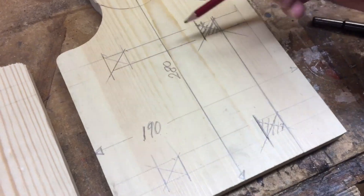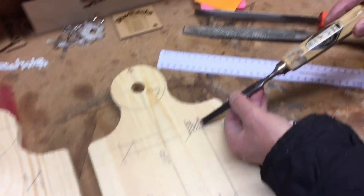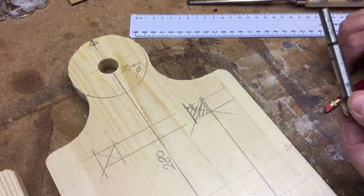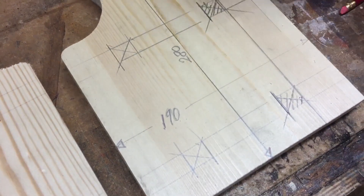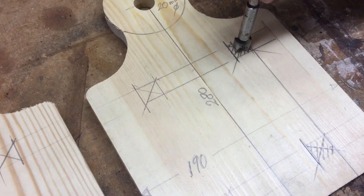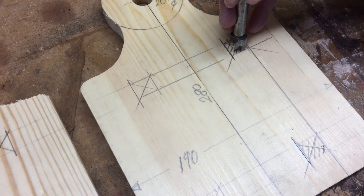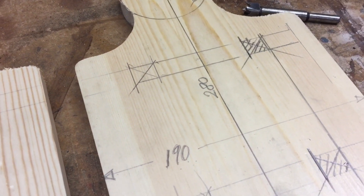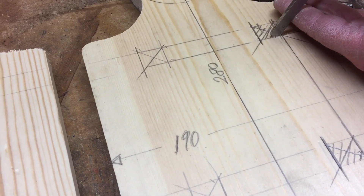Got the sides all marked out, two exactly the same. I think we could chisel that out very carefully from both sides, but to help viewers mark out the centres, do the diagonal on each of the four holes. I'll probably make a template if I did this again. Then we're going to drill that all the way through with a sacrificial piece of wood underneath, and then just chisel the corners to make sure they're nice and neat once drilled.